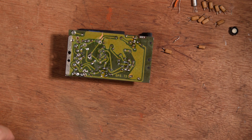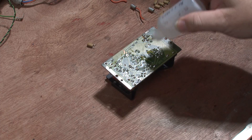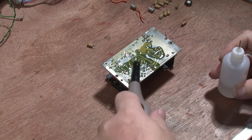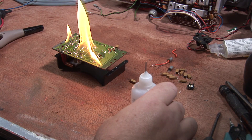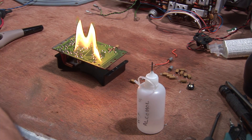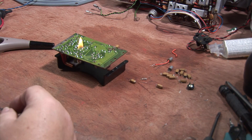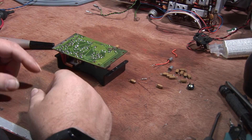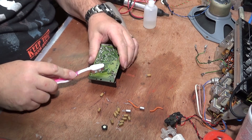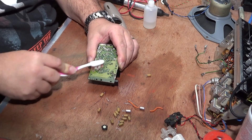There's a fluxing joke in there somewhere. So how do we clean the board up? Well, there are two ways of doing it. You can either cover the thing in isopropyl alcohol and set light to it, which will work — and you keep your hands nice and warm while it's toasting away. Or you can get busy with it, move the isopropyl, look at the board, find the bits of flux, get the cleaning brush, sprinkle isopropyl on it, give it a scrub, and that will clean up all the excess flux.